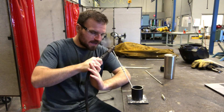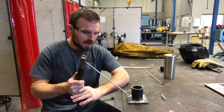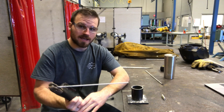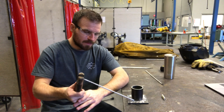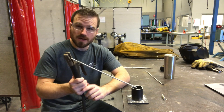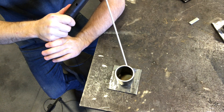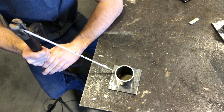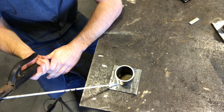You're going to start over here, arc up, and slowly turn your wrist as you're welding around that pipe to maintain a constant leading angle. Notice that I'm having to drop my hands below the surface of the table to do this. It'll take a while to get good at, but once you master it you'll make really nice beads. We're going to weld about a third of the pipe and stop.